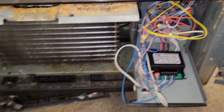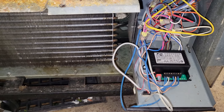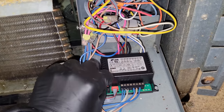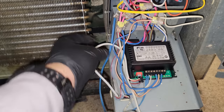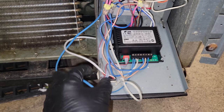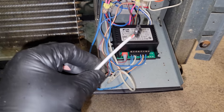I don't know if True does that or if that's LAE, but I'm gonna tell you something. This customer washes everything down at nighttime, so I'm actually gonna unplug that, because that's just an expansion cable or whatever on the module, and that's gonna get wet from them splashing the box and washing the floors at night. So we're gonna leave that unplugged because that could be a potential source.